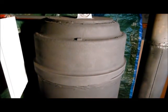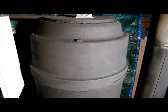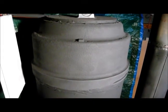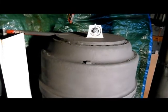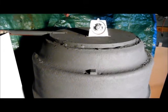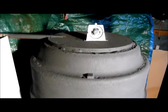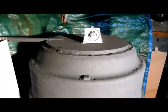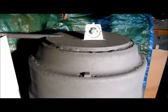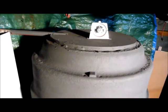I didn't have to do any modifications — it just slipped on there like a glove, and I was tickled to death. So that's where it sits. I only had to use one. It weighs 90 pounds and it absorbs and radiates a tremendous amount of heat. On top of that is a half-inch plate I had cut, welded to the top of the brake drum. In the future, I'm going to drill and tap four screw holes and cut the welds so I can take the top off and look inside and inspect.